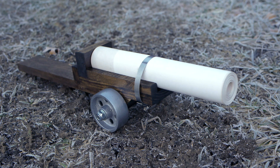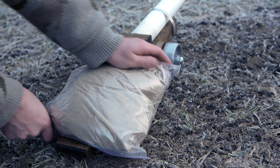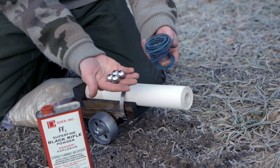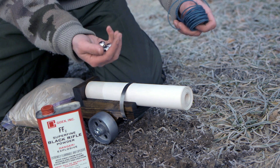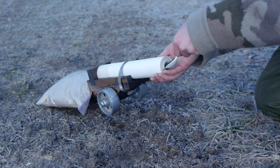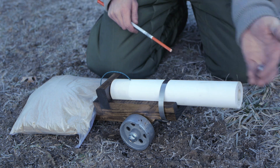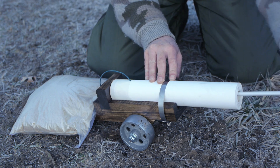Now if there's one thing I'm sure of, this cannon is going to kick, so I'll set a small sandbag on the tailstock to keep it held steady. My propellant will be black powder, and as ammunition I have these 3/4 inch ball bearings. Green visco fuse will provide ignition. One teaspoon of this muzzle loading powder should be plenty to start with. The fuse is then inserted, and some paper towel pressed down as wadding before inserting the bearing. One last layer of wadding is pressed in after, and the cannon is ready to fire.